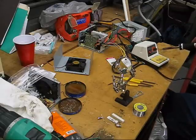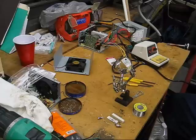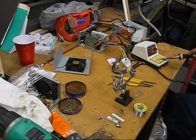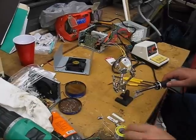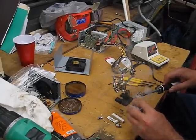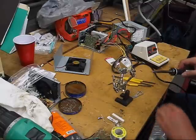The soldering kit comes with tips on the box — I recommend you read the box. The basic thing is, make sure you only use distilled water on your sponge here. Clean your tip frequently, and always make sure you've got a little bit of solder on the tip. Keep it tinned — that way your tip lasts a long, long time.